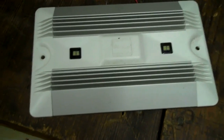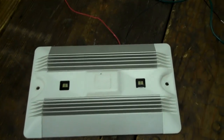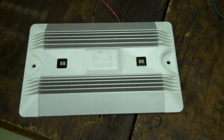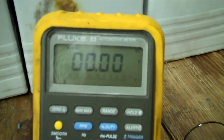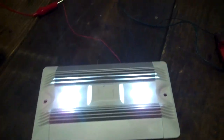That scored me an insanely bright LED, and there's only four of those things in there. You guys won't believe how bright this is. So first we're going to take a look at the amp draw on this thing and then convert it to watts, which makes sense for everybody with solar panels. I'll shove that terminal in — this thing draws about 1.2 amps, which is about 12 watts. That's not very much draw for that insane thing.